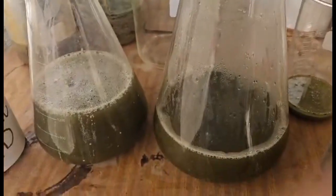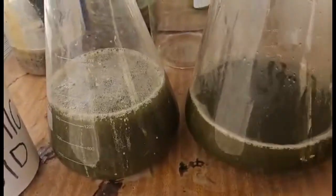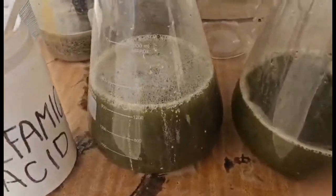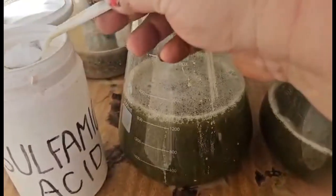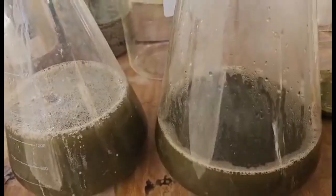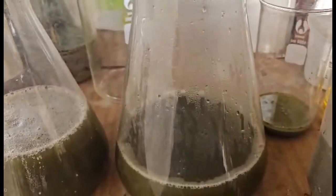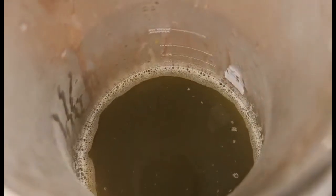This has been filtering over a couple of days, numerous times, just to make sure I get it clear from all the sludge — but it's still not 100% purified. I'm going to use stannous chloride to see if there's any reaction, and it doesn't look like there's any — that's just to check if there's any excess nitric in the solution.